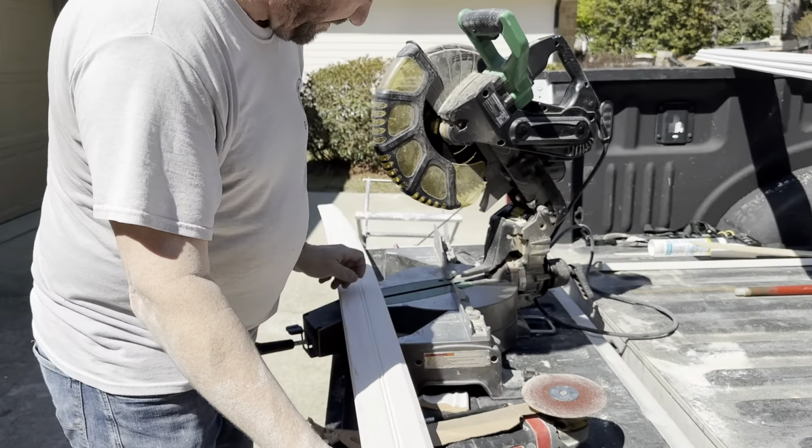The main thing is when you're doing this, just keep a good grip on your crown against the fence. Now I got to change the other side of my angle, 22.5 again. I just want to keep a good grip here. I got my thumb over it, and I'm forcing the flat part against the fence. You'll see it can rock and roll in there a little bit, but you feel it's definitely there when you hit the right spot. Check for my line.